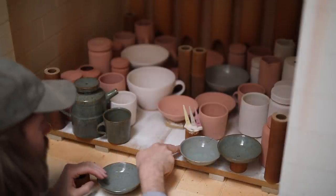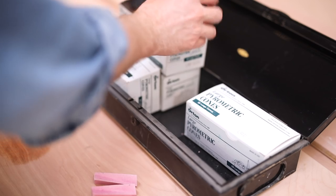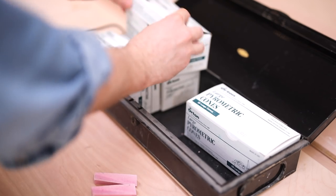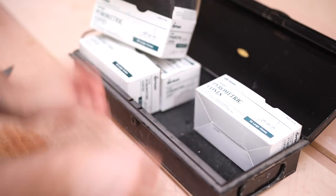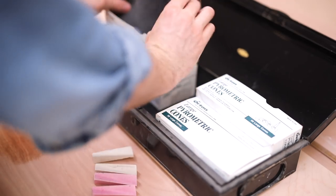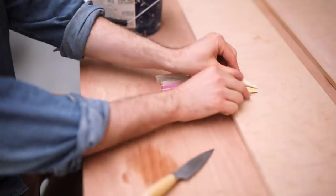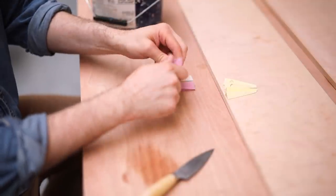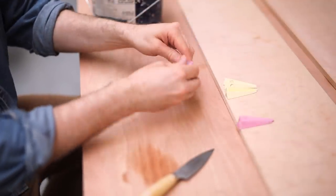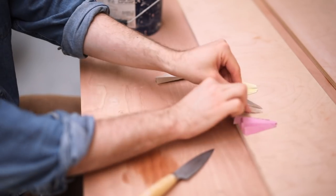These are three little coloured spikes called pyrometric cones, and they measure heat work during the firing, which is heat over time rather than just straight up temperature. I use the classic Orton cones 8, 9, and 10, which melt at about 1250, 1260, and 1285 degrees centigrade. During the firing, I carefully peek through the spy holes in the kiln's door and observe how far they've bent over. It's these cones that I'm following during the firing rather than reading the digital pyrometer's readout, but I'll show you examples of these later on so you can see what I mean by cones bending over. The creation of these cone packs is pretty simple.